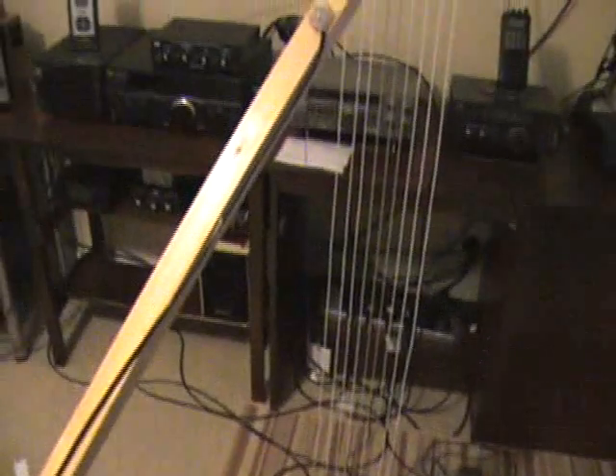I have gone to a 1-turn pickup loop — you can see the slightly reddish colour of it there. The 1-turn pickup is being fed directly into coax, and the coax goes back to the radio. On the far end of the coax I have a ferrite rod with a winding of about 15 turns, which is used to basically signal-inject into a radio's internal ferrite rod.